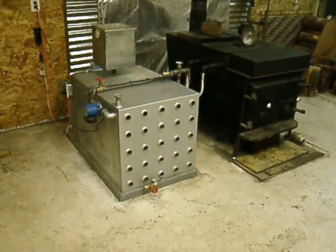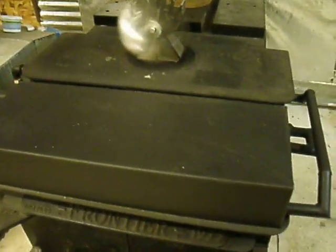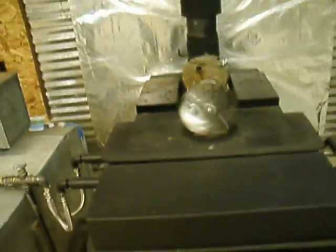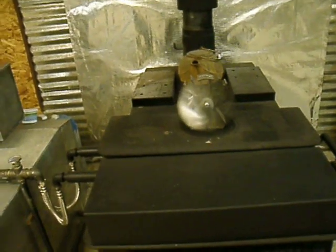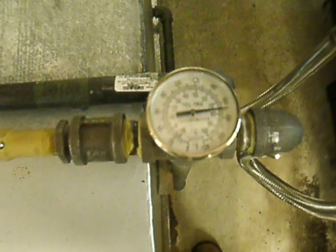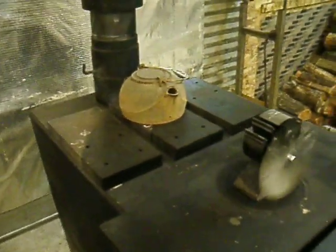There's the boiler and there's the old wood stove. If you can hear that thumping going on in this box, what's happened is the water temperature had gotten down to where the pump shut off. It'll sit here and basically percolate or boil for a couple of minutes, and right now it's going up to 160 degrees. That kicks the pump on — you can see the little green dot between the arrows there, that means the pump's kicked on. Now it'll take that five or so gallons of really hot water, shoot them back down into the tank, and keep the tank heated.